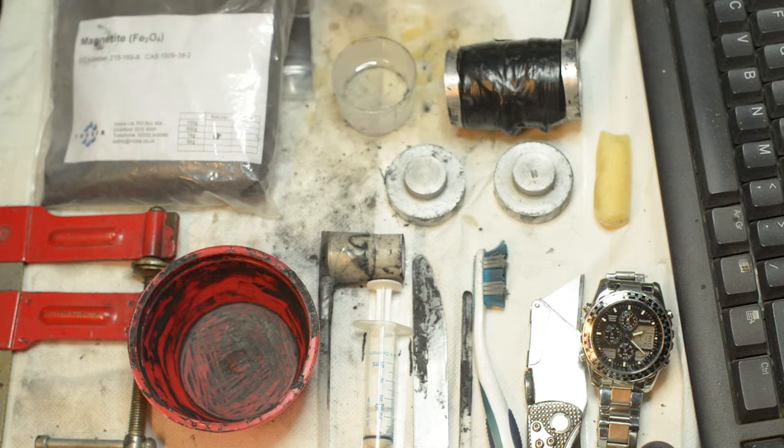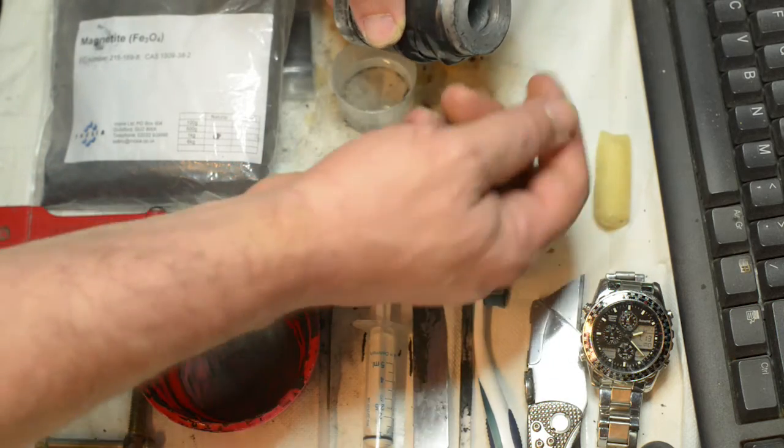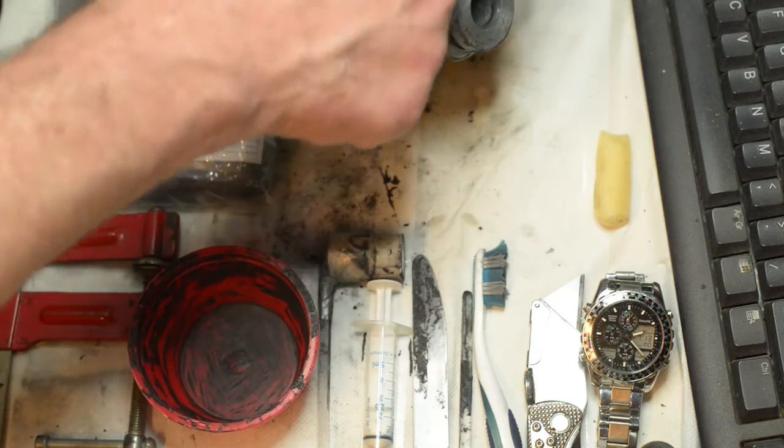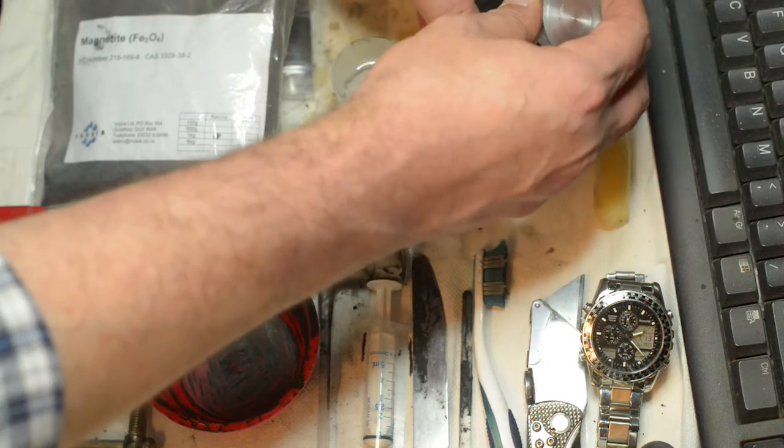Along the outside of the main mold body, a recess has been machined which is 5 millimeters deep, and that houses a bifilar wound coil with 420 turns across 7 layers. I followed Tesla's patent for a bifilar wound coil. End caps have been machined to match the main mold body, which fit as we see here.